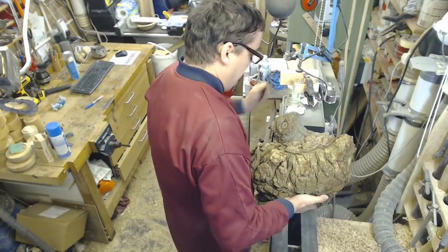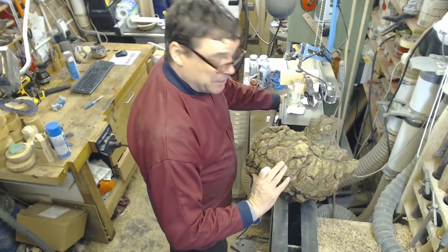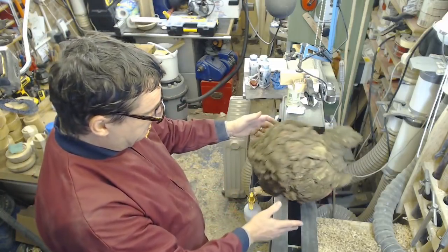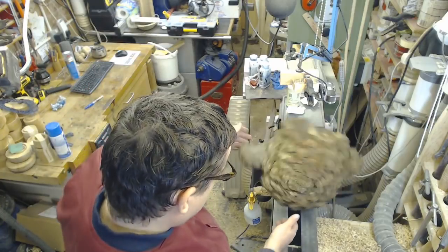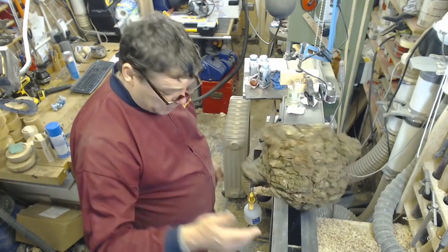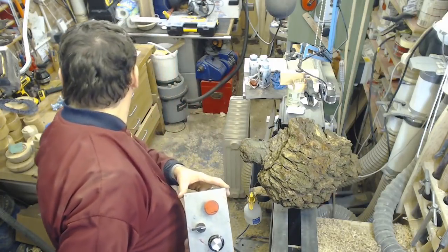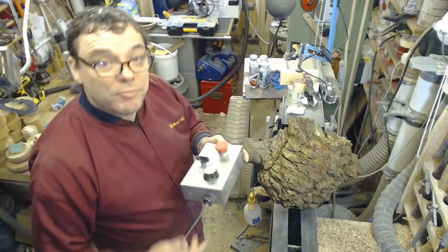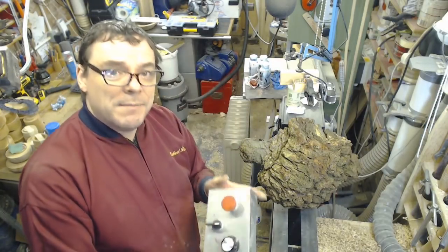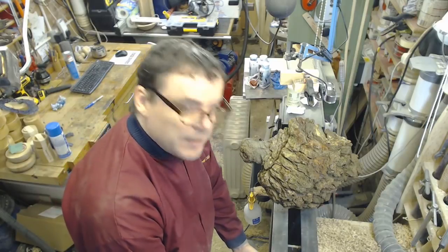This is quite recently felled and it's quite a weight, and it's not going to be very balanced — it's a lot heavier on this end than the other. Before I even put power to the lathe I'm turning the speed right down on my speed control box that I made as a breakout from the inverter housing panel. I've got it right next to me, and if my hands are full I can just lean into the stop button with my hip and everything will stop.